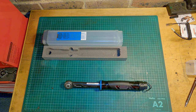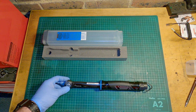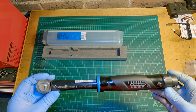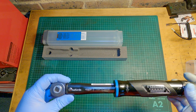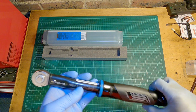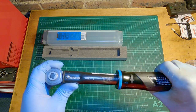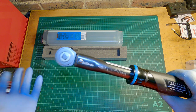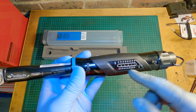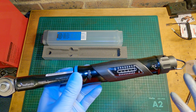Something else worth mentioning regarding reliability and accuracy is the way you use, handle, and store it. This is not your average ratchet — this is a precision instrument and should be treated with more care and respect. You don't use this to wind up bolts; just use it to take them to their final torque. You should also be careful never to drop it, because it could decalibrate it, among other damage like cracks in the plastic housing. Once it clicks, never try to force it past that — just let it click and you've got your desired torque. When storing it, always store it completely relaxed: if you used it at 40 Nm, unwind it back before putting it in the box. That releases the tension off the spring inside and helps it stay calibrated. It's also worth taking these for a calibration check once a year.